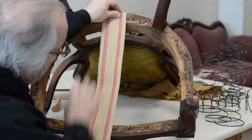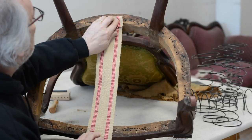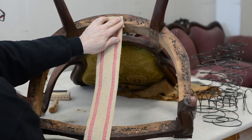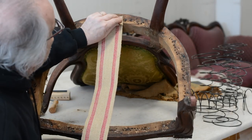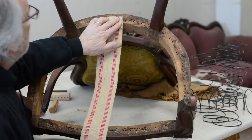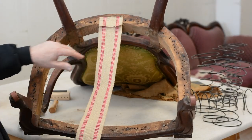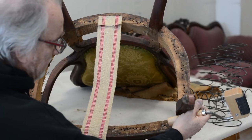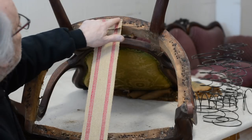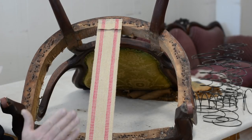Work from the webbing roll. Notice how I'm folding this over and I'm about halfway on the wood rail — look at the thick stock on these beautiful chairs. Modern furniture doesn't have stock this thick. I'm going to fold this over and get five staples, then four at front — a double row. That's at least nine staples, about the same as six-ounce tacks staggered between each one.